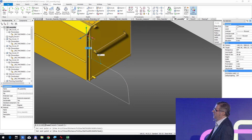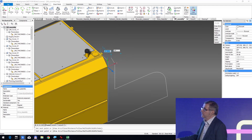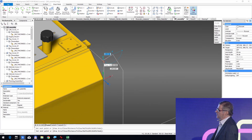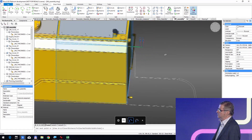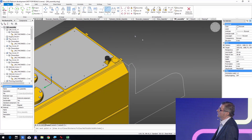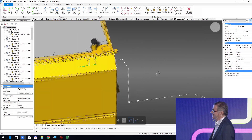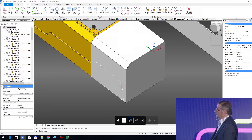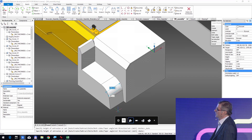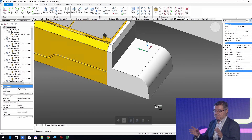Now, how to create the second assembly. If we make a mistake — for example with the height — this is not a problem, because we will use the trick of combining two extrusions. We finish the first profile by adding a chamfer. Now, two extrusions combined give us a solid — but it's a solid, not sheet metal.